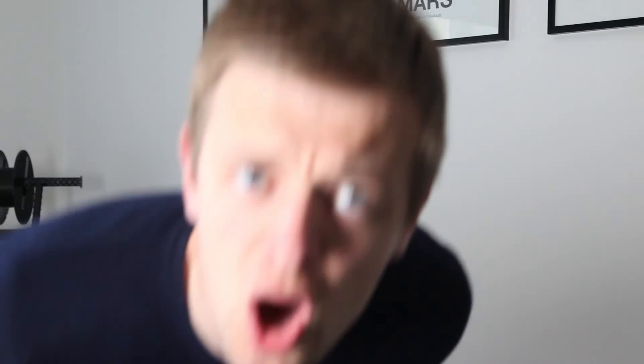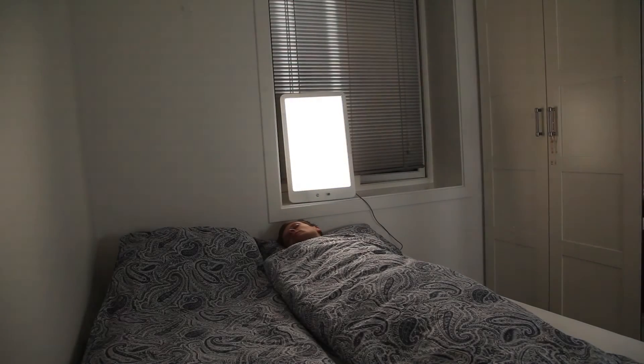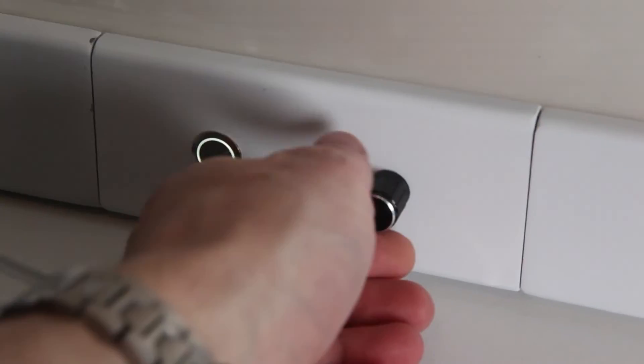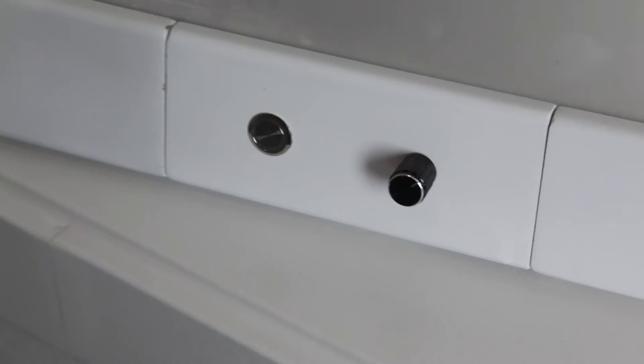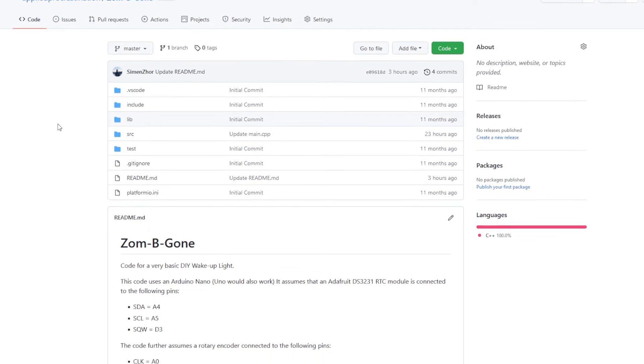The rest of the design was a lot easier to assemble and I honestly think the whole thing came out quite nice. It does work — it'll dim the light up over a set period of time to wake you up, and you can press the override button to make it a normal reading lamp that can be dimmed with a rotary encoder. To design the PCB I used the open source designs of the Arduino Nano and an Adafruit real-time clock module that can keep track of time when it's unplugged from mains. I also threw in one of the ULN2803 transistor arrays — which we used in Fetch — that can provide enough current for all these LEDs, as well as some protection circuitry. I wanted to test the PCB assembly capabilities of PCBWay, who kindly sponsored this video, and I'm very satisfied. The CAD and code for this project is uploaded to our GitHub if you want to check it out.